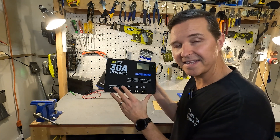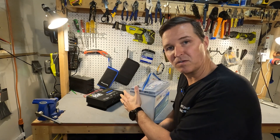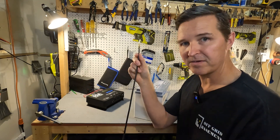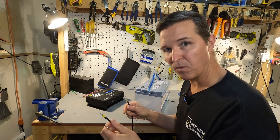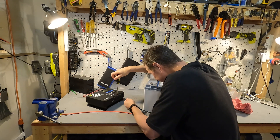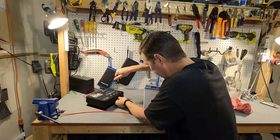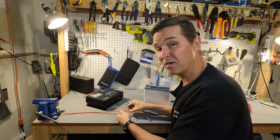Let's go ahead and connect a battery to this and see what we see. We're going to connect this solar charge controller to a 12 volt battery. We'll be using M8 ring terminals for the battery and ferrule plugs on the wire ends so we don't have stray wires going everywhere. First we're going to the battery negative — unscrew it, put in our ferrule plug, screw it back down, and make sure you screw it down really tight because you do not want these things to move around.